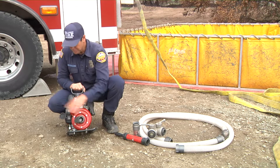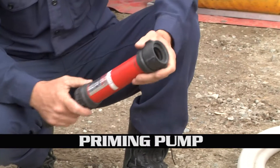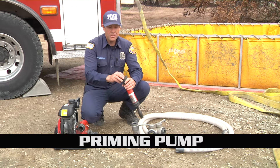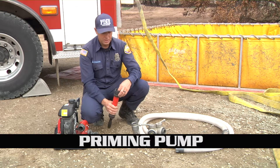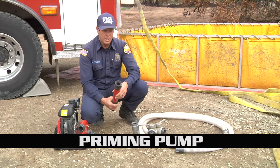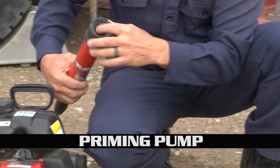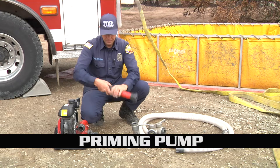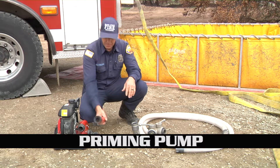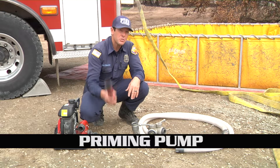Make sure your caps are on when it's stored, make sure the threads all look good. In your bag of goodies you're going to have the actual priming pump that comes with it. Make sure this doesn't just get thrown in the compartment, because that could be a real bummer when you're out there trying to get this unit to perform. Make sure the gasket is in here, make sure the primer is tightened down, and make sure it's stored in a proper position. This is something we should be exercising to make sure it works before we're out on a 20-day assignment.